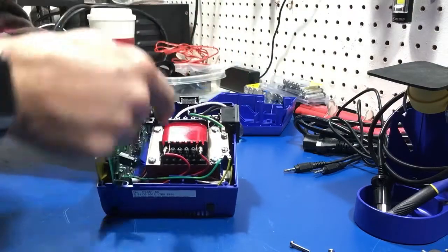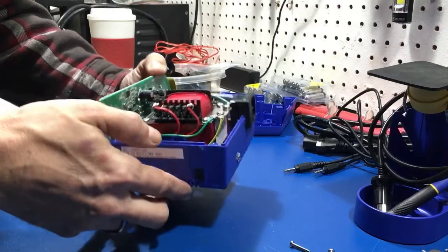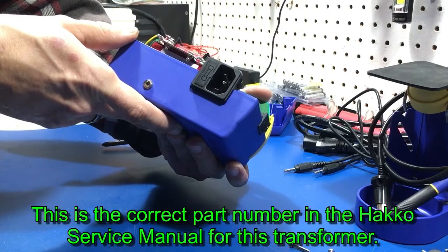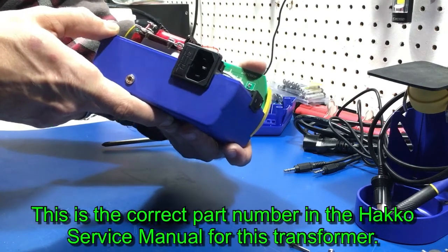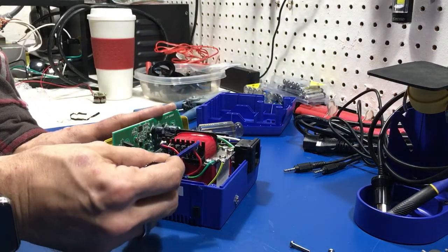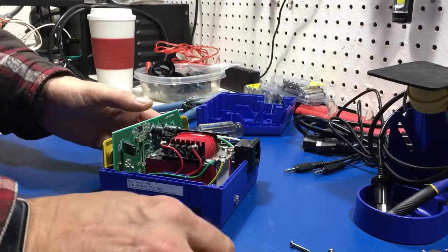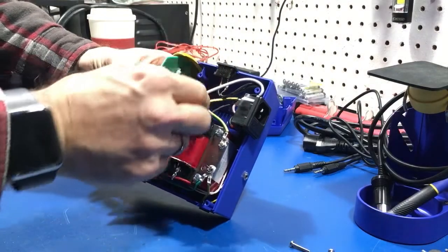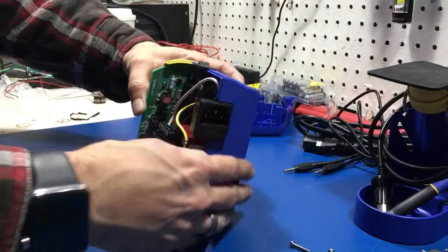We have a most definitely proper grounding to this whole entire thing, grounded out to the third pin. Single pole switch. It looks like an authentic HECO transformer — it actually has part number FP101B, ROHS compliant, made by PNE. Really good solder welds off the secondary of the transformer, really good thick wires coming in off the primary, and a fused block in the back.